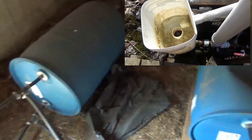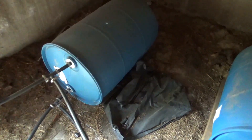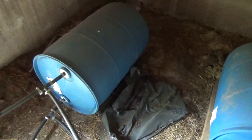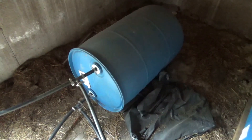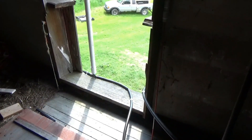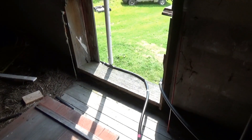That's just another awesome thing you can do with ram pumps — what a useful tool to have on the farm. Fresh spring water, about 1,400 gallons a day pumped continuously, 110 gallons in reserve up here, and 4,400 down in the pool. I may take the 275-gallon drum that's in the greenhouse for thermal mass and put it out in another spot at a reasonable elevation for over the summer, but we'll see. Anyway, that's it — I hope you found this interesting or informative. Questions and comments are welcome below, and don't forget to like and subscribe. Thanks for watching the Pharmacy Seeds Network.